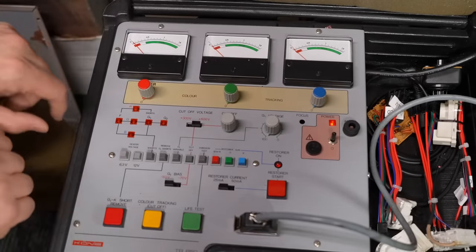I can hear people asking why I disabled those jacks. The reality is these are just very unusual jacks that I don't even have cables for. I did find an adapter from this whatever-it-is to BNC, but I'm going to be using this with 8-bit computers, so an RCA jack is just easier and better, and I'm never going to use the pass-through anyways. As far as the rest of this thing goes, it looks like it's ready for testing. Even though there's a lot of corrosion in here, it hasn't really affected any of the wires and all the controls look okay.